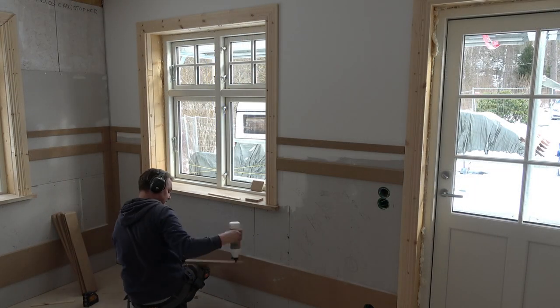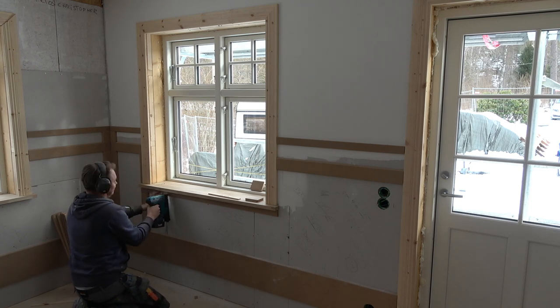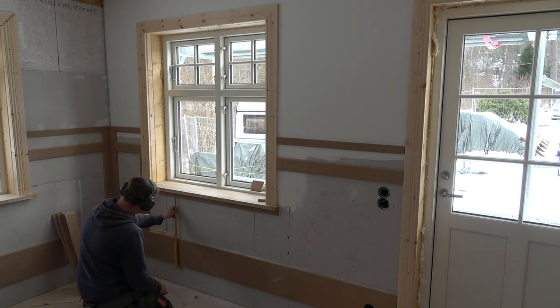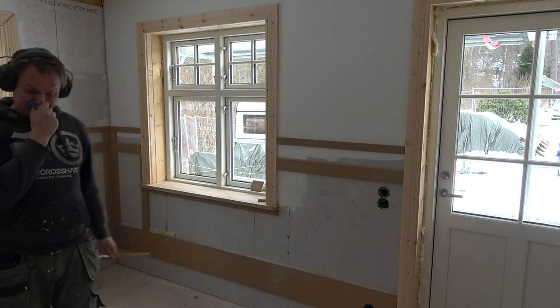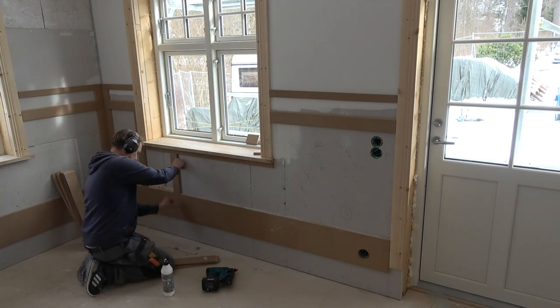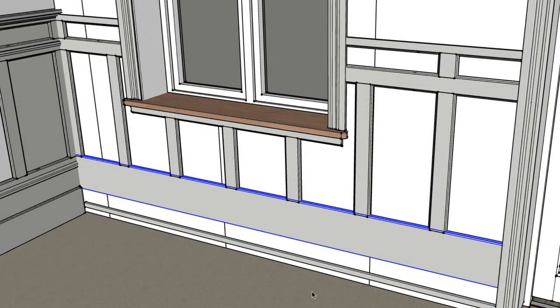So how do you build this type of panel? I can build in the background and explain during the work. Before I start with the panel, I have temporarily attached all the door and window moldings, including the window sill. The material I use is called MDF, consisting of very fine shavings that highlight details very well. You can find MDF in most hardware stores. The thickness of the MDF board is 16 mm. I start by nailing and gluing a 24 cm wide MDF strip to the bottom, chosen so that my electrical sockets end up correctly. All of you who bought CAD drawings of the house can see exact measurements — I will update your drawings as soon as I can.